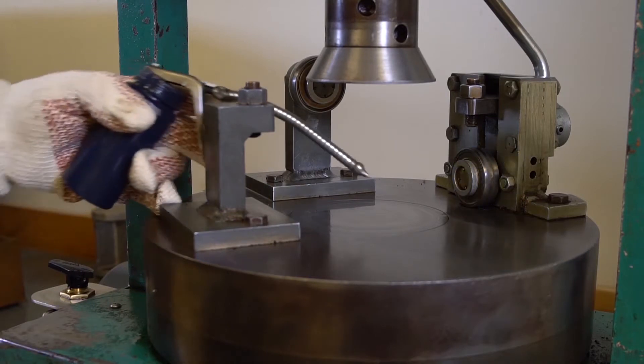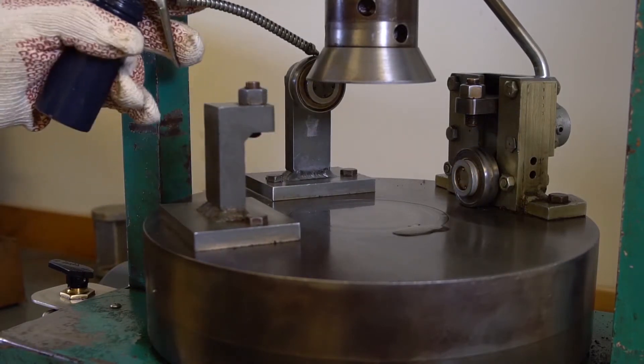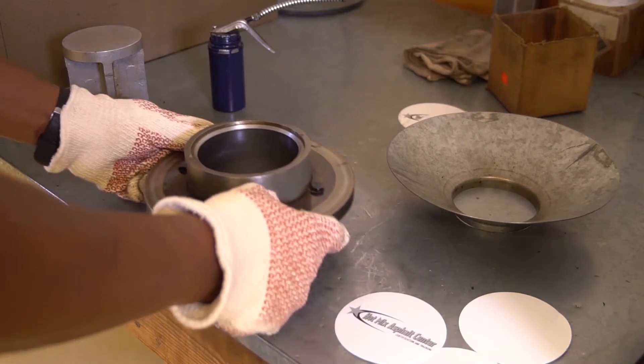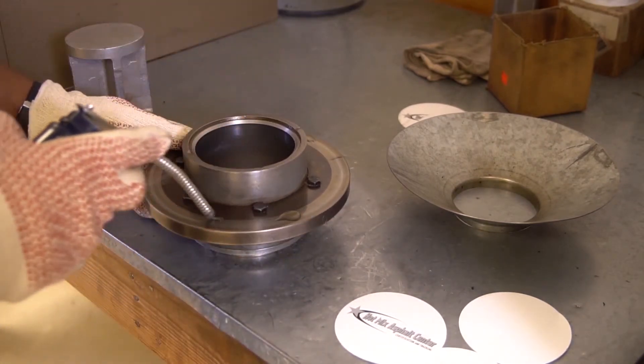Place a small amount of lightweight oil in the center of the motorized platen and a drop or two on the surface of the lower bearing. Squirt a small ring of oil around the periphery of the mold on the top surface of the hardening steel ring.